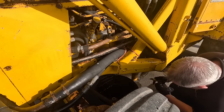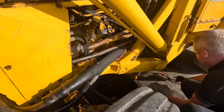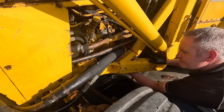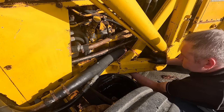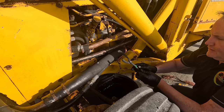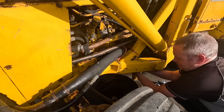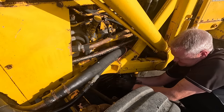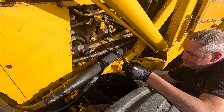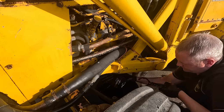There's a cord tying up this other hydraulic filter, whatever it is — I'm going to have to address that and see what the hell that is. I'm trying to get this filter off. The problem is I don't know if I can get at it with a wrench and this ram here is pouring hydraulic oil all over me as I work. These filter wrenches are all right for certain types of filters — I've also got a chain which I'll probably have to use. I've got a grip in it anyway — there we go. These are very handy.